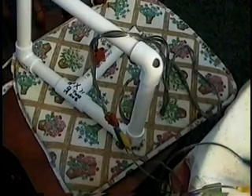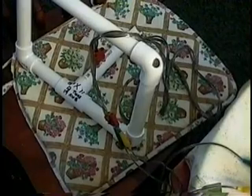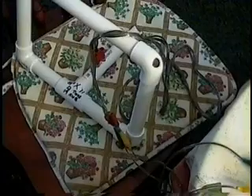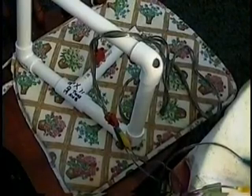Transformers are a linear device, so even though this is a 4-watt transformer, it'll work fine all the way down into the microwatts and even lower. Because of its low cost — less than $11 at MCM Audio — and its ready availability made by Atlas Sound for PA use, and being a 4-watt small size that probably won't get discontinued, this is a good candidate for a loop transformer.